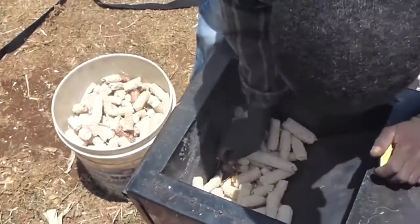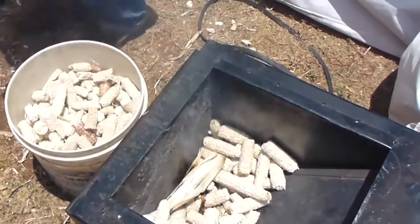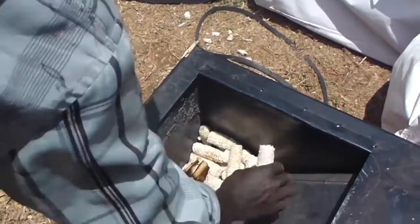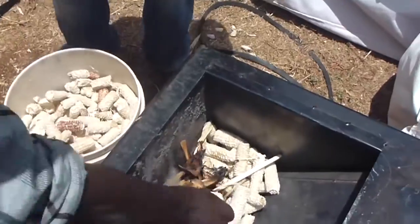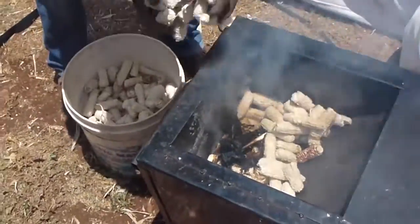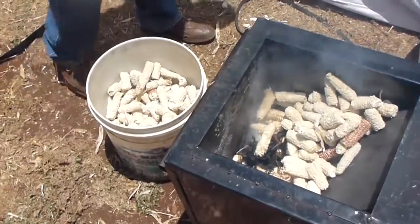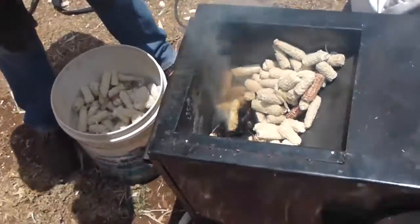On the left hand side you can see the grate that's inserted into the furnace part. Here we load it up with maize cobs to reduce the operating costs of the whole machine. You start a small fire with small cobs until it gets burning really well and you've got a nice big red glowing ball, and then you pile the maize cobs up the side so they drop down into the fire through gravity, so that you don't have to put your hands into the middle of the furnace.